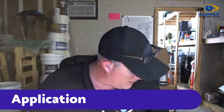You'll eliminate a lot of that blub, blub kind of stuff that makes it fling all over the place. So we'll tear off the little tab that's right here, pull it off, and then stick a blender down into it and blend it up just a little bit with a drill, to make sure it's nice and evenly blended. Then we'll drop our tube into it, and we use a 12-volt sprayer, 2.2 gallon or 1 gallon per minute. Just depends on where we're at and what we're doing.